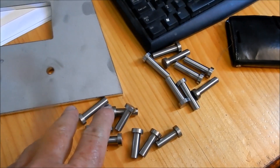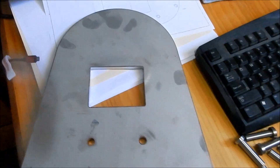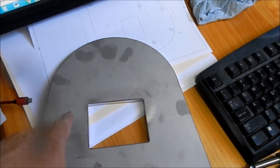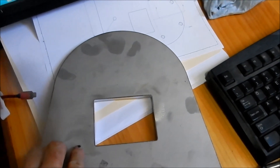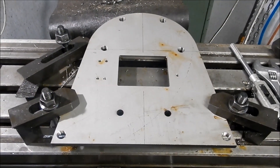That's all our stays done — we've got nine of one length and eight of another length. That's the back head where the fire hole door has to go. How that arrangement is going to be done still has to be decided, but there will be some machining, drilling, and tapping of holes to fit that fire hole door frame in place.